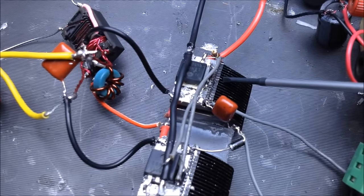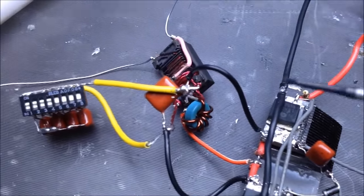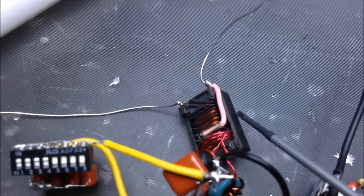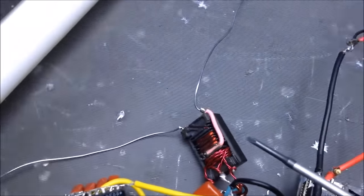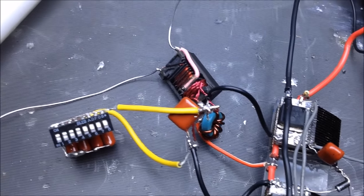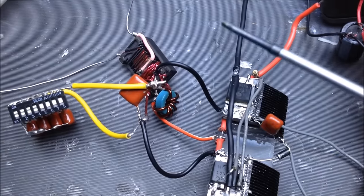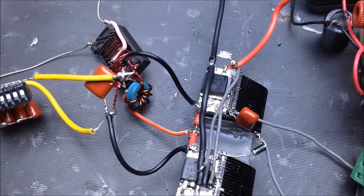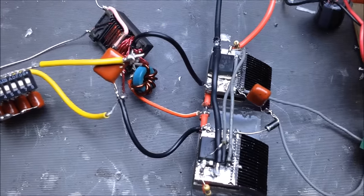So, essentially, when you have your basic ZVS circuit built, now you're going to have to worry about the actual hard part. So we have three parts. We have the inductor, the resonant capacitor, and a high voltage transformer in this case. Whether it's a step up or step down transformer isn't really important. But you're going to have to tune the transformer to work at its maximum efficiency. That's basically making sure that the circuit is properly oscillating the magnetics, making the magnetics flip back and forth at the proper saturation of the transformer. Not doing this can make the system work ineffectively and overdrive certain parts on the circuit, such as the MOSFETs, making them warmer than necessary.